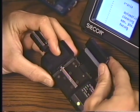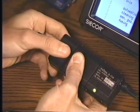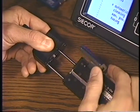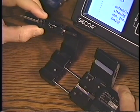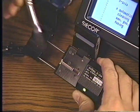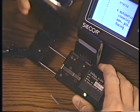Close the flap over the handler and close the flap over the ribbon and push down firmly so that the blades can bite into the ribbon coating. Pull back gently after about 3 to 5 seconds to remove the coating. You may need to repeat this step to remove all the coating. We'll cover some common problems in the troubleshooting section later. Be sure to thoroughly clean the stripper after each use.